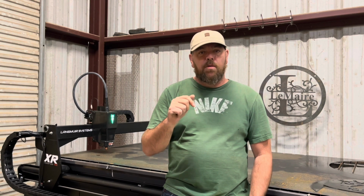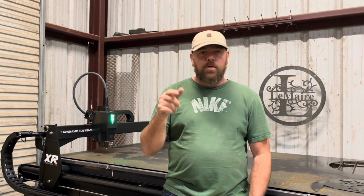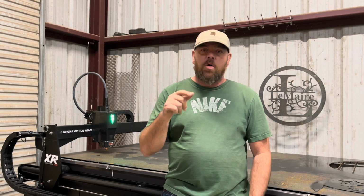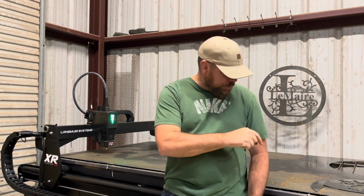That was such a goat rope for me to try and get all that together while the caulk's drying. But like I said, I've had no problems with the caulk. I will tell you that whenever you're done putting your table together, go back and take the rest of the caulk and go around all the screw heads and go up the edge of the pans.